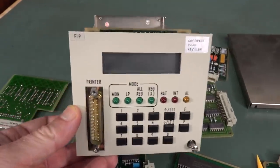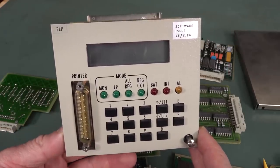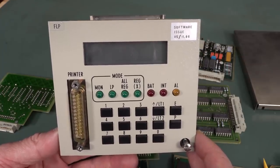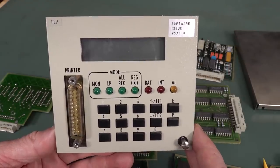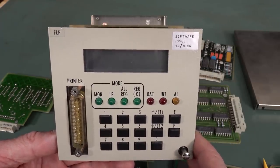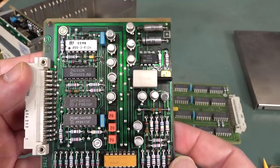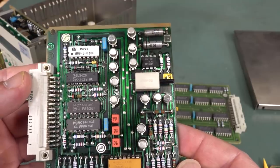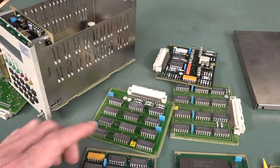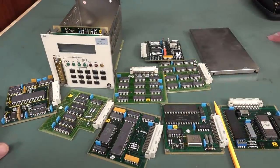But what does it do? I don't know. It's an LCD. It's got an 8031 processor. It's got some gate arrays to do something special that the processor couldn't. So maybe it needed some faster real-timey action for that. But it seems to be doing some serial decoding or something. And it's got lots of bus latching and other stuff going on. And it's got some analog-y goodness. I don't think we saw an ADC on there, did we? So I don't think it's converting. It's not like it's getting any analog sensor data and converting it. So yeah, I don't know. That's a very strange one.